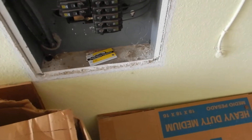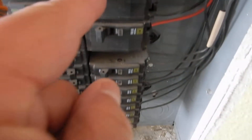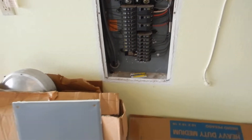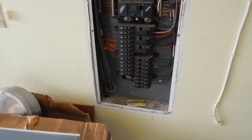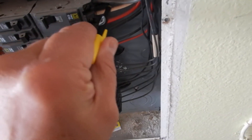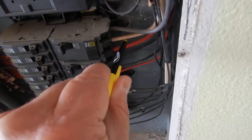In the AC video we're going to find out that it's 50 amp, but we've got a 60 amp fuse. So this fuse for the condensing unit — the HVAC condensing unit — is over-fused; it's larger than the manufacturer specified. Also, this white cable coming in here is a white hot.